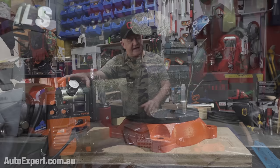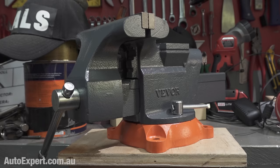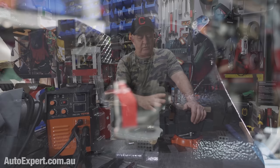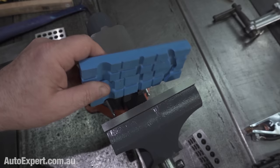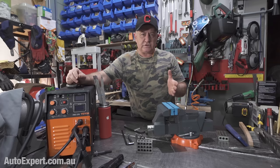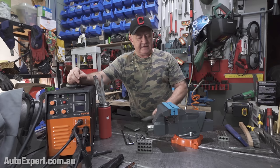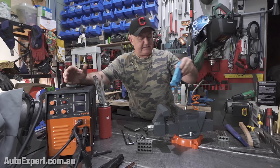The vice is kind of interesting too, because it's under $100 and seems like a pretty good vice for that price — a six-inch jaw with roughly 90 millimetres of throat depth and opens up to about 175mm. It comes with magnetic soft jaws that just stick on if you want to protect what you're working on. That's important sometimes because the jaws are hardened steel and can be quite aggressive. Soft jaws are a real bonus when you're working on something with a decent surface finish you don't want to mar.